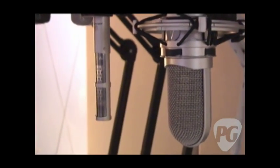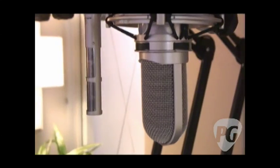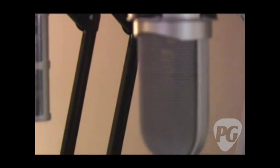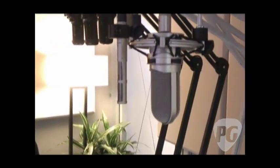The thing that's cool about these is that they use a proprietary process on the ribbons. There are about 18 Audio-Technica patents on the construction of these ribbons. Why is that important to guitar players? One of our primary driving factors was durability. We've incorporated a dual ribbon design, and when we form the ribbon, we press it in a tool and imprint what looks like a brick road pattern on the diaphragm itself. We call that a microlinear imprint.